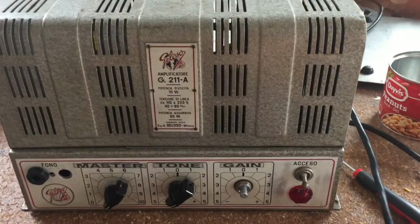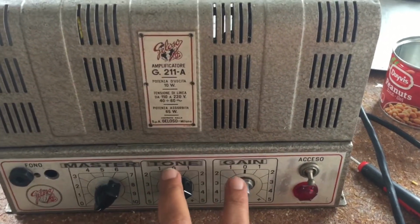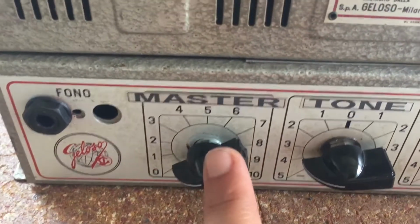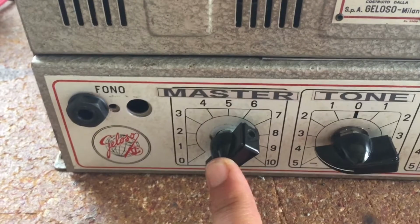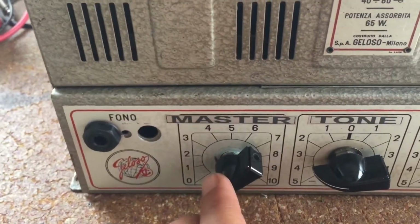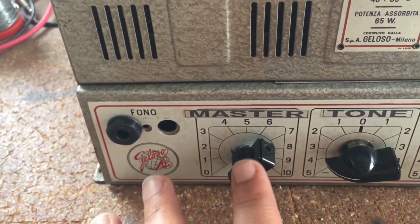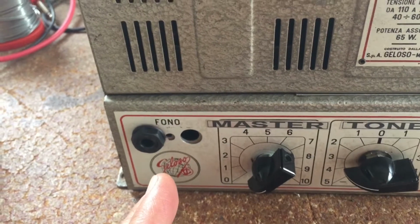Well, a lot of changes to the G211. I implemented the Fender Deluxe tone stack. Then I also introduced the master volume control, which is not post-inverter but pre-inverter. Because it's using the cathodyne phase inverter, and there's no gain in this phase inverter, it makes absolutely no difference if you put the master volume control before it or after it.